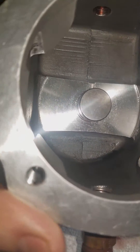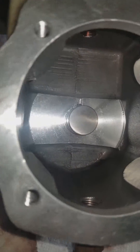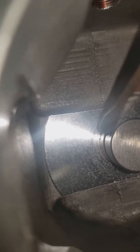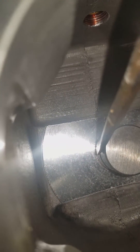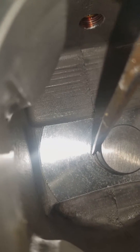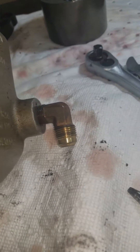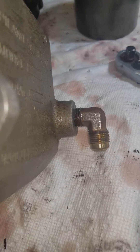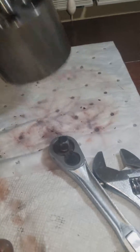So how does all this work? If you look inside, you'll see that this round piece has a slit on it — right down there on the side. This slit is going to be feeding oil or pulling oil from port. The other side is going to be feeding or pulling oil from starboard. There are check valves with ball bearings down in here that I haven't pulled out yet — they're relatively simple.